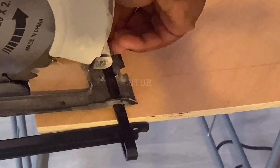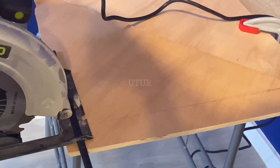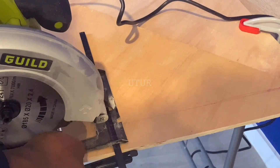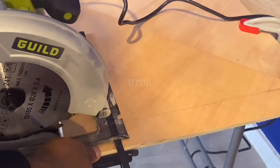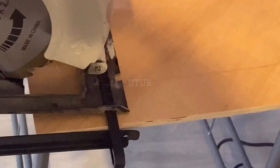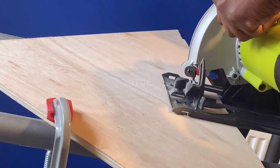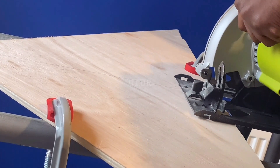For a simulation of how the blade impacts or cuts through the plywood, let's revert back to the initial highlights of making diagonal cuts with the circular saw. The only difference is that in this case we've included the rip fence or parallel guide to enable accurate cuts, as opposed to doing it freehand with the cutting line. This is what freehand looks like in relation to the cutting line when making diagonal cuts.